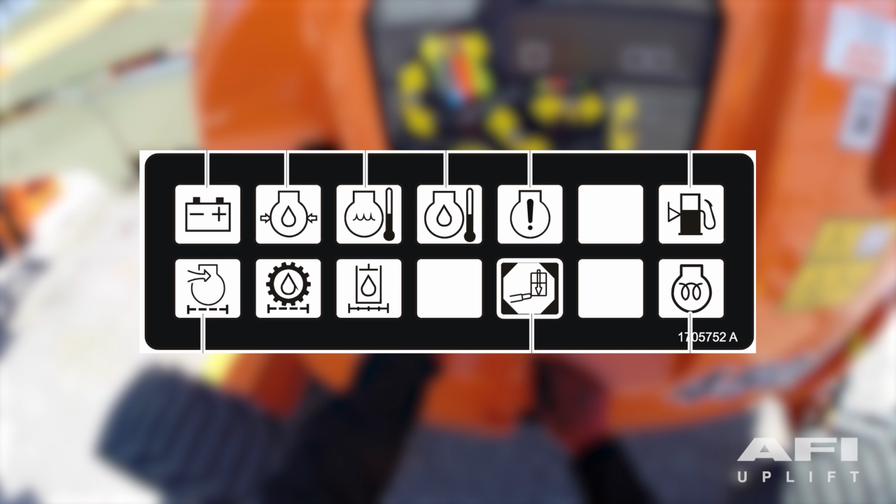Battery charging indicator. When illuminated, indicates a problem in the battery or charging circuit and service is required. If this is illuminated, please return to ground level, isolate, tag, and report to your supervisor and manager to have this attended to. Engine air filter indicator. When illuminated, this indicates that the air filter needs to be cleaned or replaced. Please return to ground level, isolate, tag, and report this to your supervisor or manager and have the machine inspected and repaired.